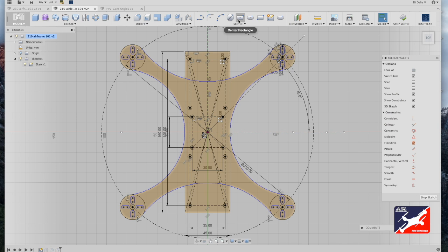To begin with, let's establish the first-person video camera mounting slot by going into Sketch, Center Point Slot. In the forward section of the drone, use the construction guidelines and click, drag out, and let's make this a value of 1.5 millimeters. Now let's add battery straps to hold the battery down.